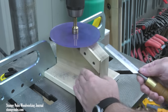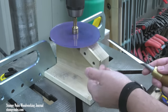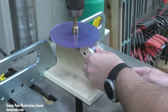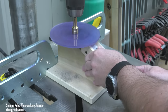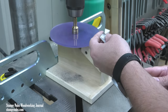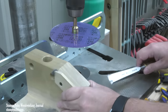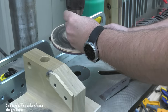The jig simply slips under the disc, and my drill press is running at the normal speed I usually use it at. The whole point is for this to be quick and simple, so I didn't worry about it. I am using a plunging motion to reduce heat buildup, but the sandpaper on the bottom of the disc is not regular paper, so it doesn't generate much heat anyway. I'll explain more about that in a minute. After less than 10 seconds on the 80-grit, I can already feel a heavy burr on the back, which tells me that my bevel is already entirely reground and repaired, so I swap my discs.